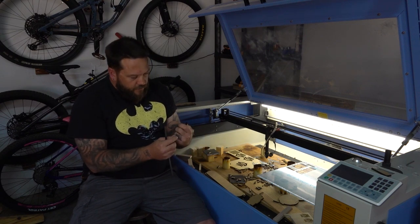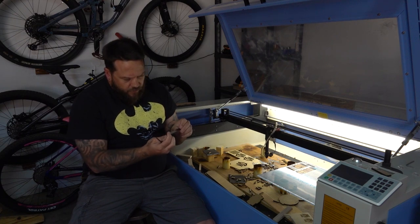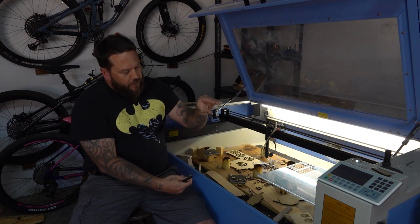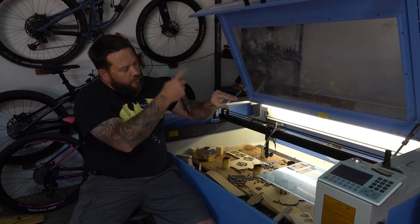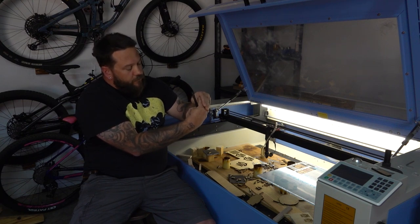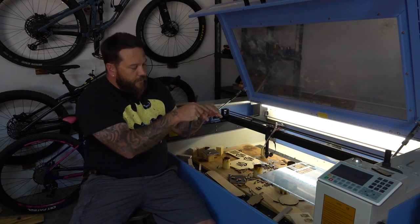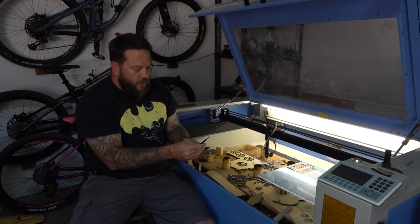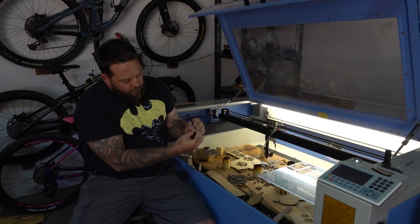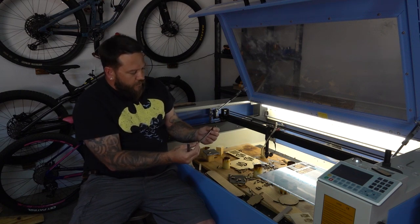So one of the next designs I had is actually this one over here. In the one end I made a female type of part, and on the other end a male, so that they could stick together, and then if I put them together with CA glue, perhaps that extra surface area would make it stronger. But being that this belt was so thin, I couldn't really get that gap to print properly, so that didn't work either.